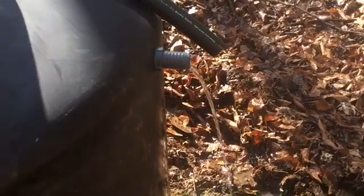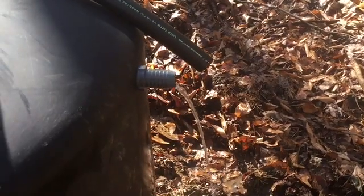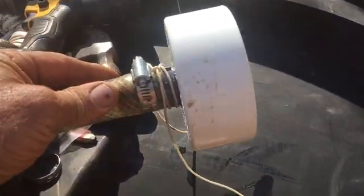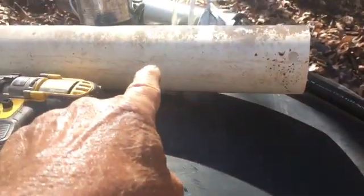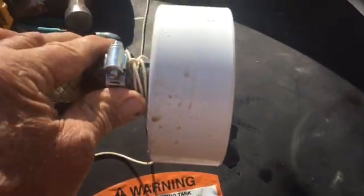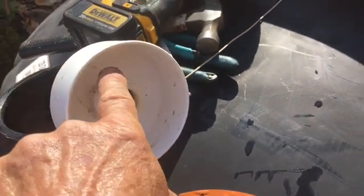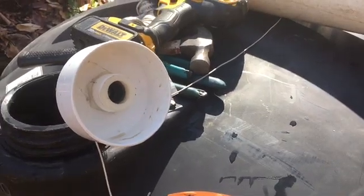As usual, I forgot to bring a measuring cup. But temporarily, here is what that spring's doing right now — we've got to go up there and cement it up. This is what I have here: the pump is going to screw in over here. This is a four-inch piece of pipe just like well casing. We're going to put that piece of pipe over it. The well pump is in the middle. This is nothing but a one-inch barb, inch-and-a-quarter hole in that cap. We're going to drill a hole for the wires to come out in the rope.